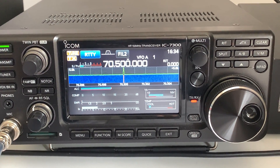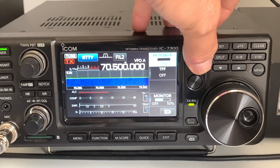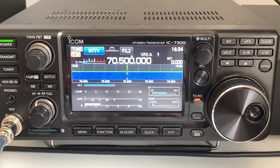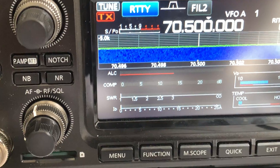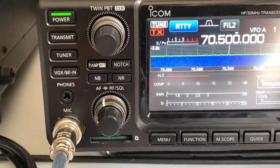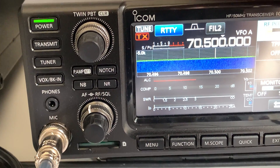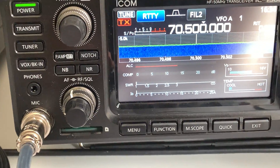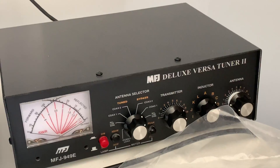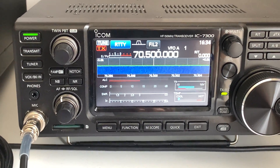I've got it on RTTY — just tuning it there. Matched. You can see the SWR here — with 15 watts it barely registers. With the radio auto-matching system it's matched itself — got a perfect match. I'm running it through the MFJ but on bypass.